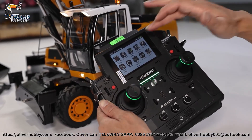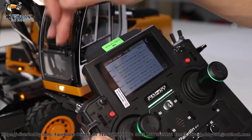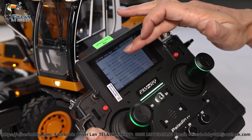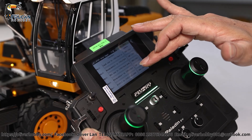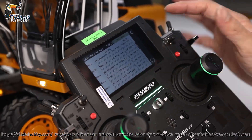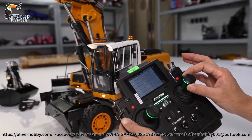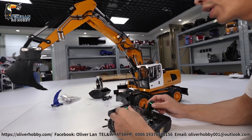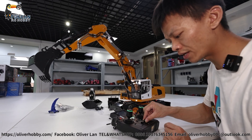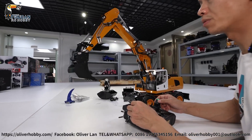If you go to Pro-Mix, from Pro-Mix here you will see all the mix controls — walking mode and driver mode same. Eight mix controls in total: all for the hydraulic pump, big arm, small arm, manipulator two, middle arm, manipulator one, front leg, rear blade — all mix control. SWC press down: mix control is off, no starting the pump. Release SWC: mix is on, immediately starts the pump. For operation, always keep VRB turning a little to keep the pump running at low speed for quick reaction and smoother operation.